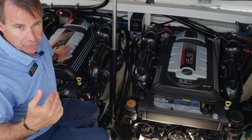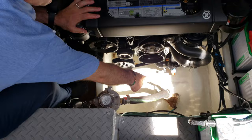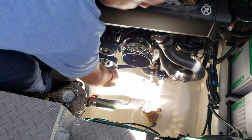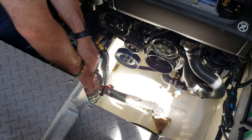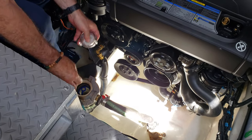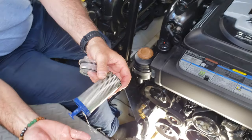What I would do first and foremost is close your seacock, which is right here — you would close this down. That shuts the water flow off. Then open your basket strainer — you would open up your basket strainer and go in here and see if there's any debris.